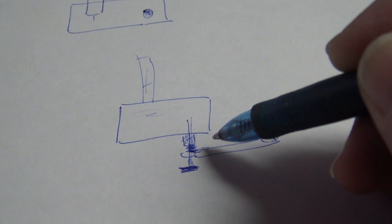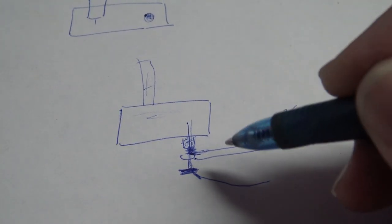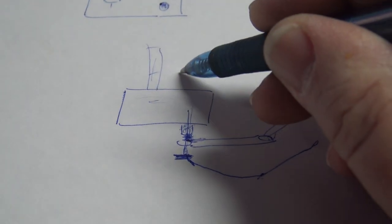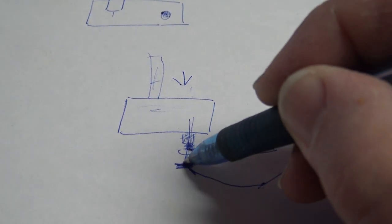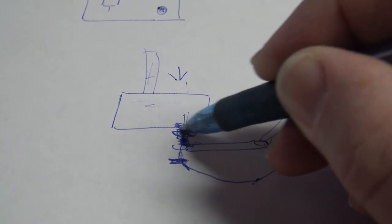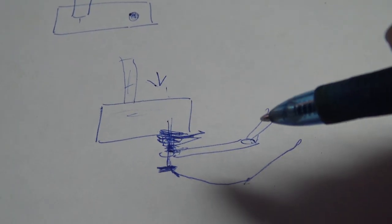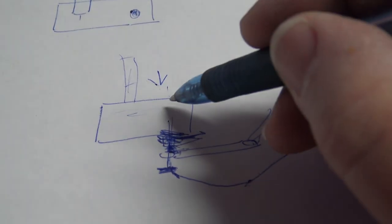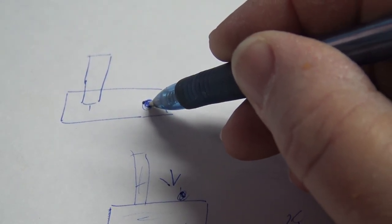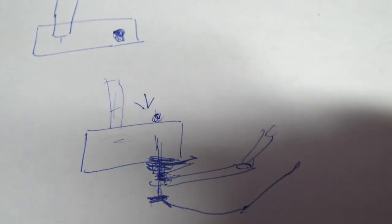So the goal is to get the dental pick underneath here, hold this in place, and then push down on the top of the guide base to push this pin up so that it's flush, and hold this arm up against the bottom of the base. That's what we need to do — and it can be done without taking the mechanism apart. Then we're going to put a bit of crazy glue on top here, fill that hole with crazy glue so it gets down into the base and holds that pin so that it can't pull back down.